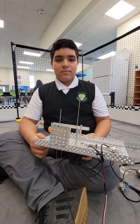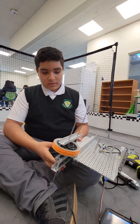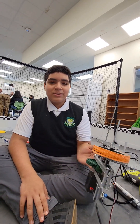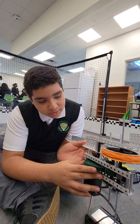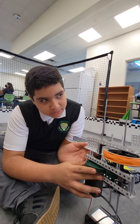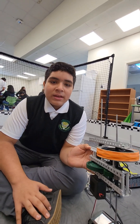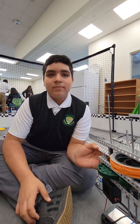So that's a nice indexer. Tell us a little bit about the actual flywheel. Is this your first iteration? Definitely not. The first iteration, we used a green motor and we just had a really high gear ratio, which was a 15 to 1, I believe. That had too little torque, so it couldn't fire anything.